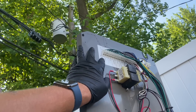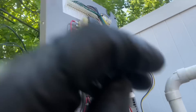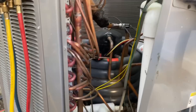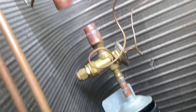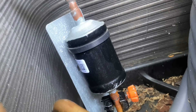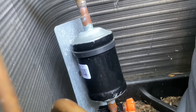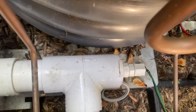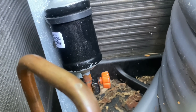Disconnected my wires to my water sensors, my EXV, suction and coil, and outdoor air sensors. Unscrewed a couple screws at the bottom along the sides and slid this thing out of the way. That allowed me to get my Milwaukee M12 tubing cutter in and I cut the top of the TXV before it went into the distributor cap. Got my little mini cutters in right there and we're going to cut out the filter dryer. It is zip tied with a big duct tie to a piece of metal — I don't know why, maybe to protect something at the factory. It's attached to the bottom of the compressor. Let me finish cutting that out and show you what I'm working with.